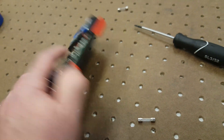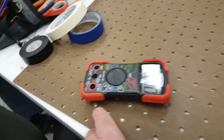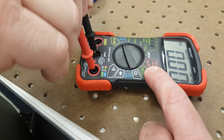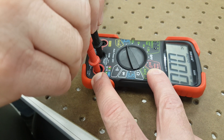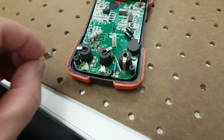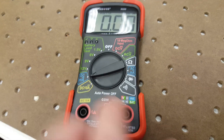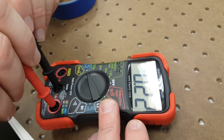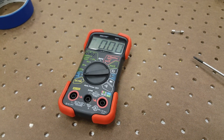So we've got a little experiment. We're set up to read milliamps and we have another meter here, and we're going to do a continuity check across our volt-ohm setting plug and the common, the negative part. See that? Nothing. Now I'm going to put the good fuse in. I put a good fuse in and we're measuring from the common to the volt-ohm milliamp part, and you see it gets a tone — it's reading through that fuse. So that's how you could check your fuse with another meter if you suspect you've blown it.